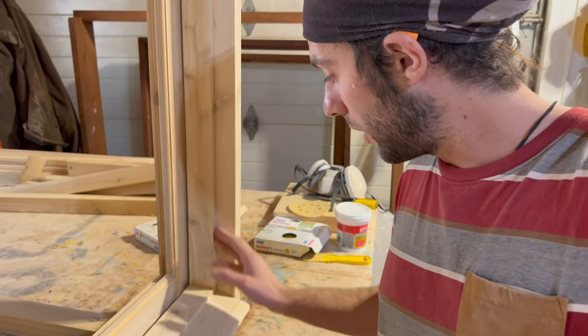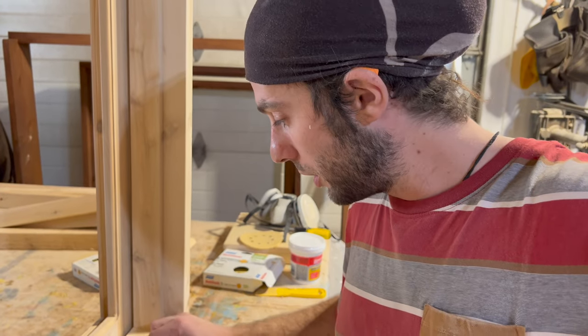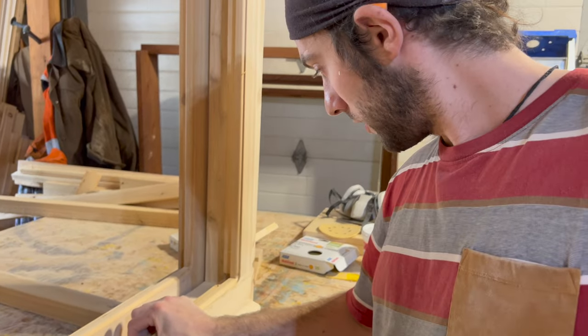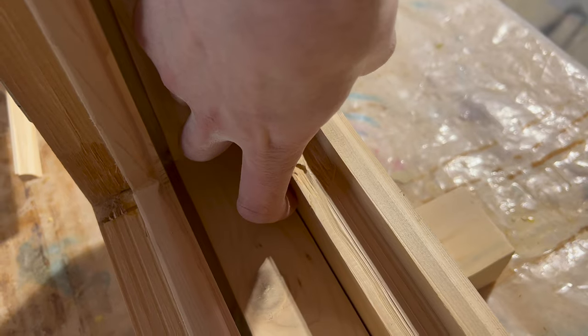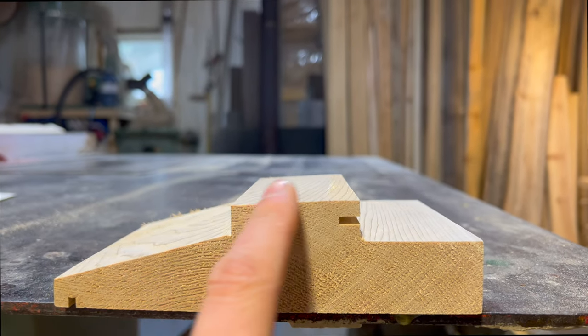It's a pretty simple way to build windows, but it works very well. And I forgot to say that the mosquito net here is not glued or anything, so the water can still go through the frame here. This is a mosquito net frame. Okay, we'll go like that. And inside, all over there, there's no glue or anything, so the water can always go through this little crack and slide down outside. Here, a side view of the base of the window.